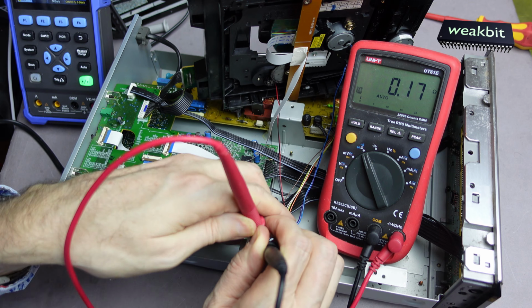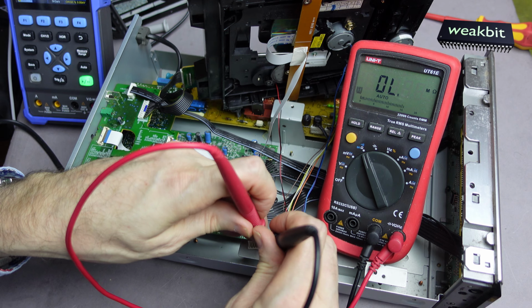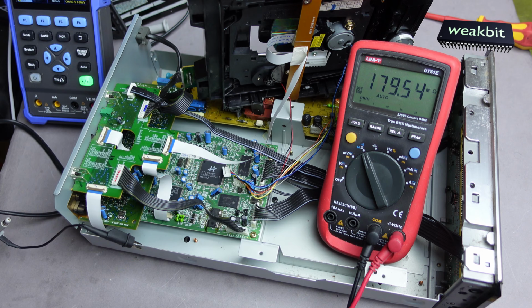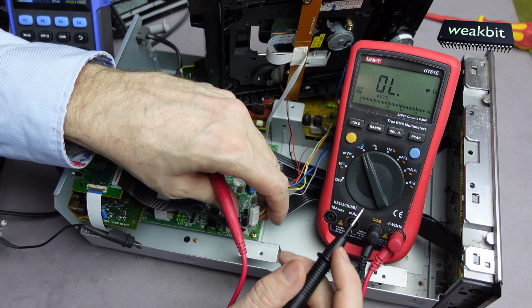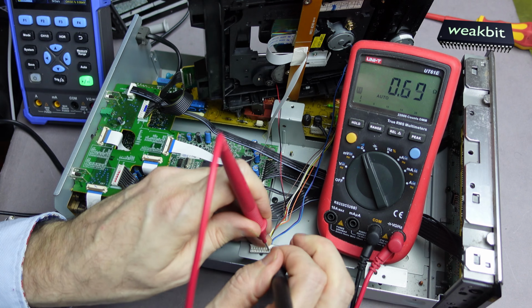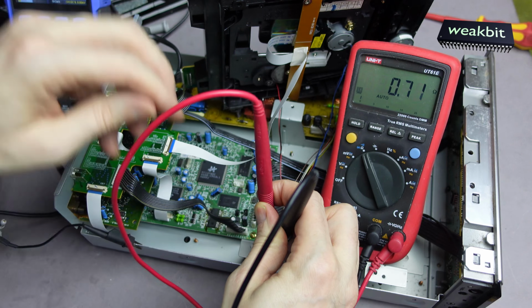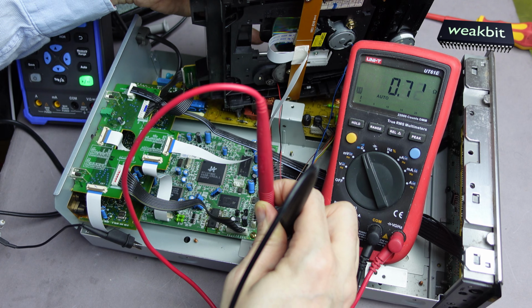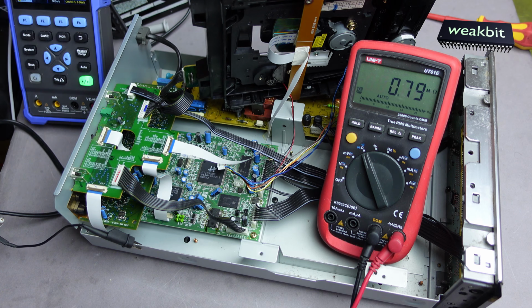Hey, come on. Short. I make a short here. I need a motor. I think I need a motor. This motor destroys the other IC, and now we can see this is not good. I spin it, but 0.7 ohms for a motor, this is not. I think it's a 2 or 3 ohm motor. Yeah, this is okay, but not seriously. Yeah, I take.